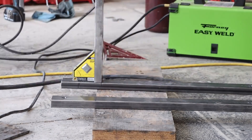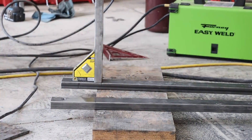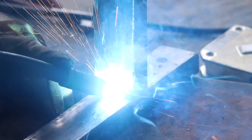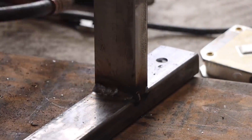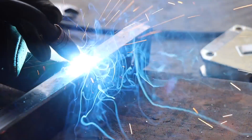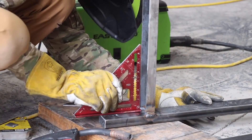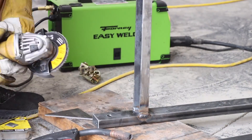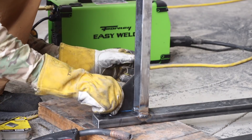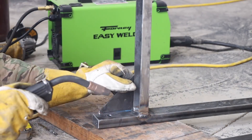I want to send a shout-out to Forney for sending me one of their Easy Weld units. This unit is really good because it does MIG, stick, and TIG. It's a small unit — you can run it on a 15 or 20 amp circuit, no 240 volt required, just 120V. For doing small projects like this it's going to be really useful. Maybe if I get more into metal fabrication in the future I'll need a different model with more features, but for basic fabrication this is really all I need — I don't need a fancy several-thousand-dollar machine since I'm not doing this professionally.